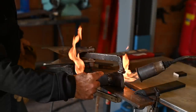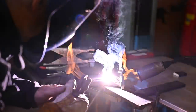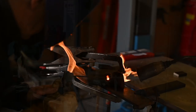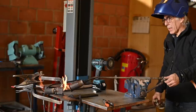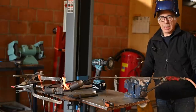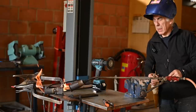I have it tacked in place, so now I can weld the other side. The weld looks reasonably good. Now I'm going to let it cool down — I'll still leave a little bit of gas flowing through at minimal to let it cool at ease. I'll let it sit here for a few minutes and then gradually remove the flame so it cools down nicely and doesn't crack.